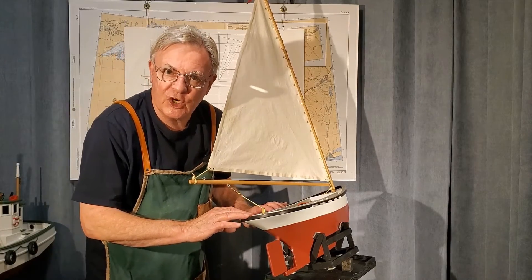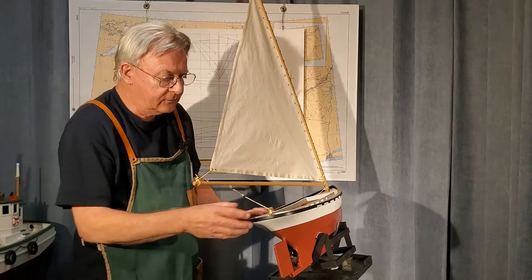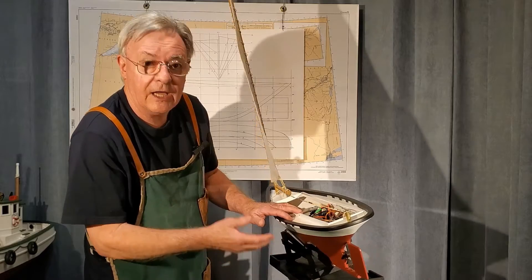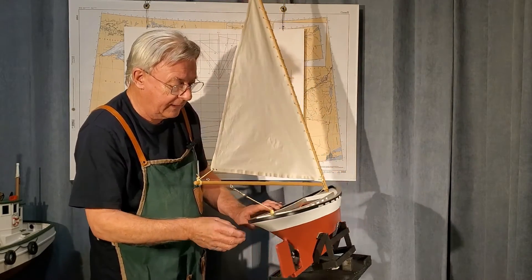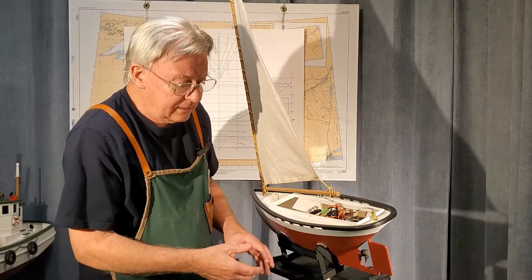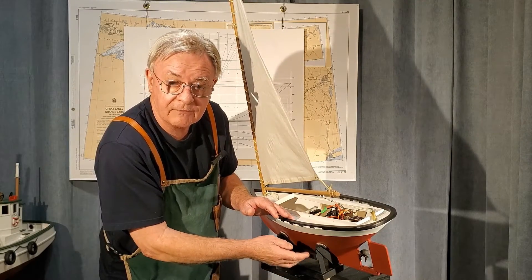Here's the Vendure back on the table. There are a few things I did notice about the sail test. The first one is the boat is extremely tender. With four pounds of ballast down at the bottom of the keel interior, the boat still didn't have enough stability to prevent the railing from going underwater even with the slightest gust. A way around it could be to use lead, with the lead further down and more concentrated at the bottom of the keel.